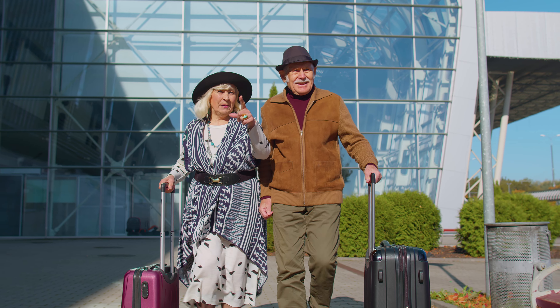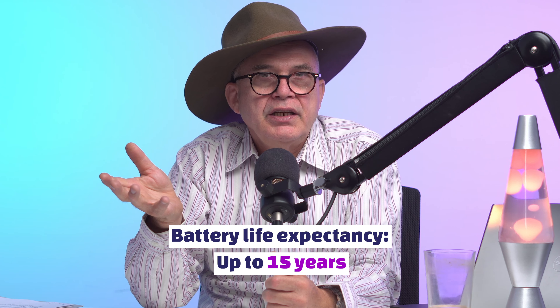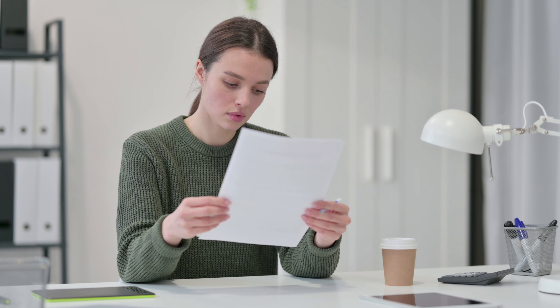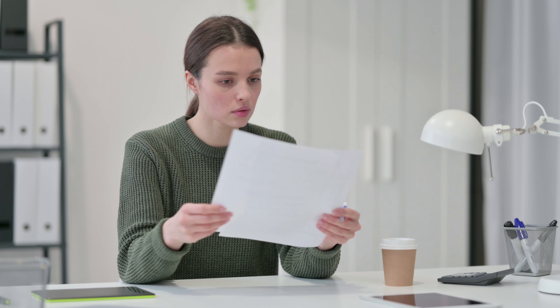We're not necessarily going to do 10 kilowatt hours every day perfectly — we'll do a few less, and we go on holidays. So overall, you would expect to get around 15 years from a battery with that kind of warranty. It's very important if you're considering buying batteries and want to compare them that you actually read the warranty document and check how the warranty is expressed in order to compare them properly.